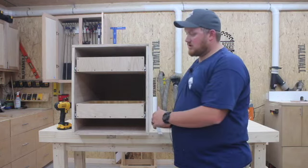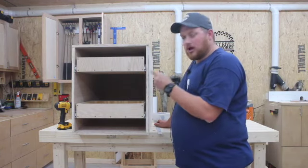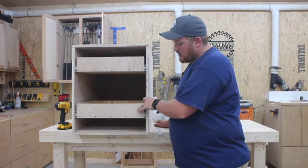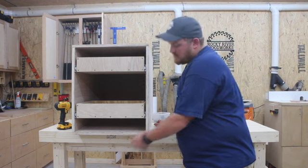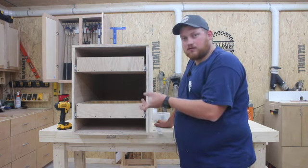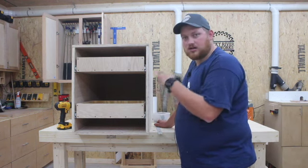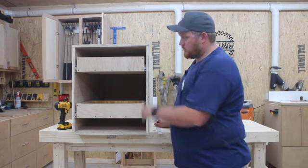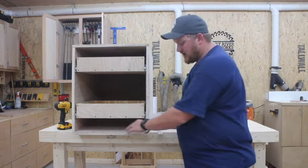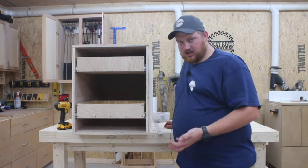The drawers are installed. You could add a drawer front on here if you want with a handle — I probably will do that eventually, but for right now I'm just going to leave it like it is. The next thing I'm going to do is add some two by four runners on the bottom. That'll give me something a little bit beefier to drill in casters. I'm going to install some two inch locking swivel casters to make it mobile, and then add a couple of two by fours on the inside in the front and back just to give it some extra rigidity.